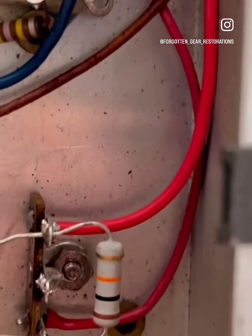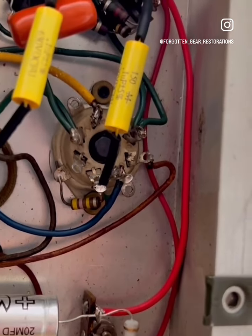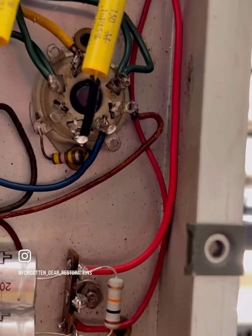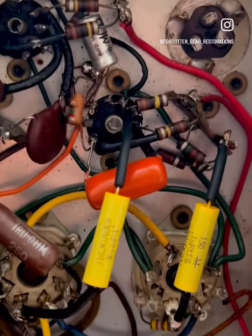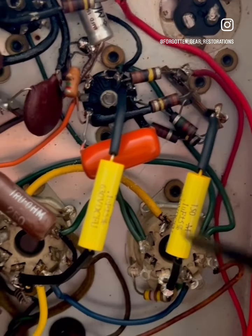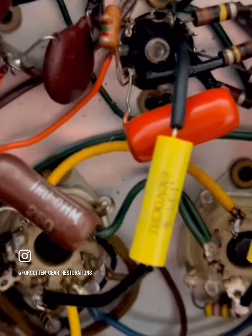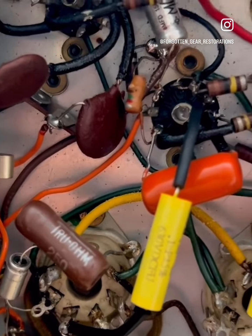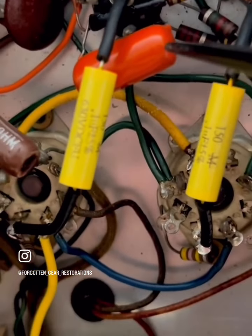And let me get in there for you. Now, one of your wires I was able to reuse, and then I ran another red lead over, which goes over to V1 tube, which are your two gain stages, and then we have obviously the phase inverter over here. We have all new cathode bypass caps. Plate resistors are great. New phase inverter coupling caps. Your other ones were literally destroyed. Ooh, doggy. Your phase inverter input cap is new, and I actually took one of these out of my stash. I hand test all these old vintage ones that I was given from the electronics professor over at Orange Coast College. So that's going to treat you nice.